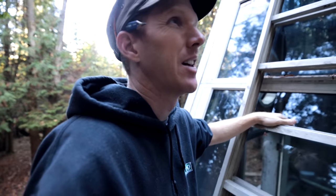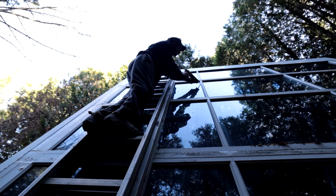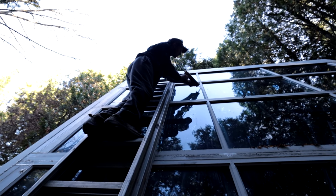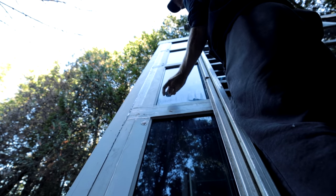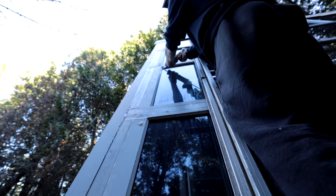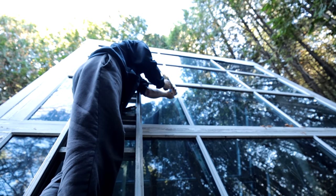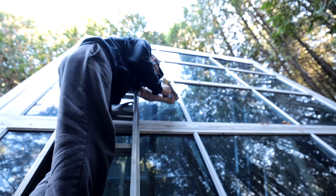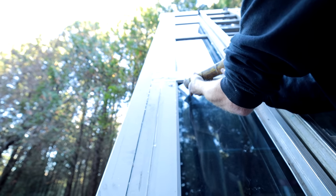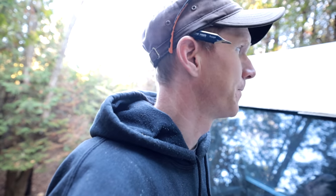There's a limited window of opportunity to caulk all these garage door window panels. The spec called for waterproof glazing between the panels, but what I was finding when it rained was water coming in at the sides of the mullions. So I'll caulk both sides of each one, let it dry, then caulk the tops and bottoms the next day. Then you wait for it to rain and check again to see if more caulking is needed. Hey, it is what it is — it's a glass building.